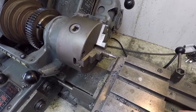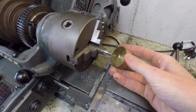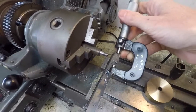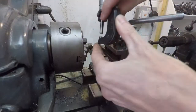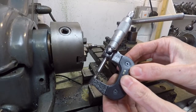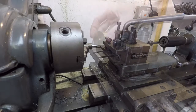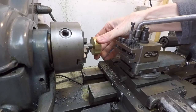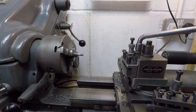The final job is to turn the plain portion of the stub mandrel to precisely six millimetres in diameter so that it's a very good fit on our flywheel. At the moment it won't go on, but it's got to be a good fit. So I'm going to measure the diameter with a micrometer and then apply the appropriate cut using the cross slide to get it spot on. It comes out at 6.21 mm, so it needs to take 0.21 mm off. That's pretty good — virtually shake-free fit. Close enough. So the stub mandrel is now ready to go.